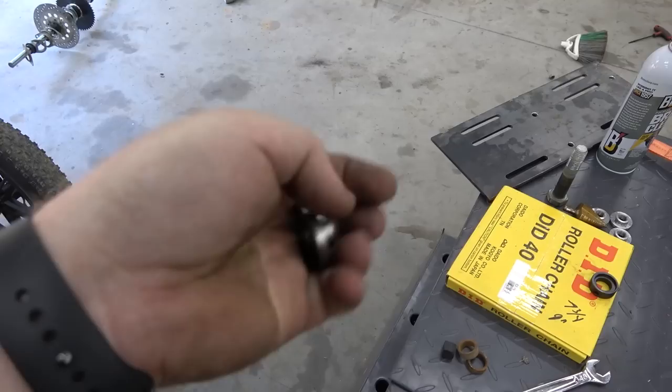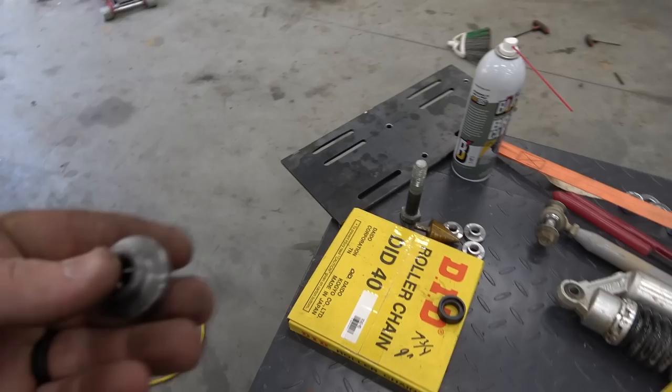And how I'm going to bolt them is, a long time ago I ordered, I don't know what you call these, but they're like weld in threads, and these are half inch fine thread. So we're going to drill a 3/4 inch hole for these to lay in the frame and then weld them, and that'll give us good strong threads for these pillow blocks.